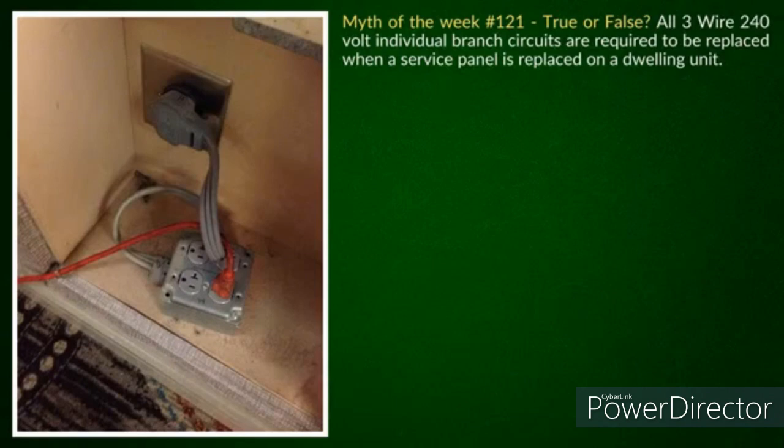Well, sure, it's crazy. And if you think about it, when they size based on what the service is for the grounding electrode conductor, it's not done based on what the calculated load and everything is. It's what that service is rated for, and the conductors coming into it. That's how you go about sizing it. And it's like I've always said, if you're sizing to the metal water pipe or you're sizing to the building steel, it's based on the conductors. Everything else, it already gives you a size.